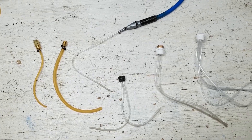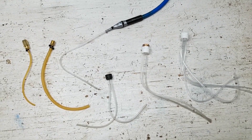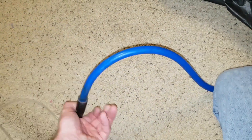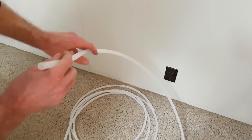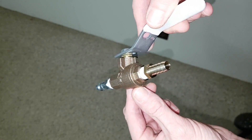All these whips worked well for me. The quad whip never got all four tubes going, but it helped me better understand the airflow limits of the quarter inch couplers, hoses, and fittings. The flexibility of the hose that the whip was attached to prevented me from pushing the whip through long segments of duct. A drain snake sort of helped, but a much better solution is a stiffer hose. In an upcoming video I'll assemble and test such a hose and show the results.